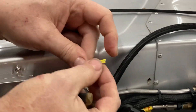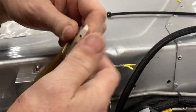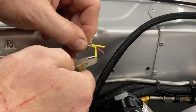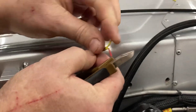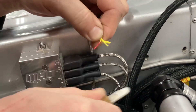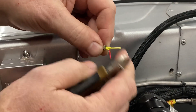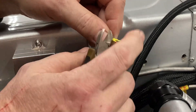Then you've got to get that outer piece off, and it's kind of slippery — you almost have to scare it off. So I'll take the dykes and just rough it up a little bit, and then it falls back like that. This one is trying to be difficult also, so give a little squeeze of the dykes and there it falls back. That's more of a feel thing — I can't really tell you exactly how much pressure, but just a light pressure where you're scraping it but not cutting the inside wire.